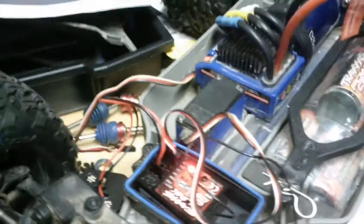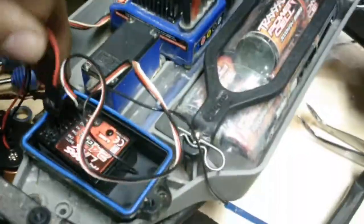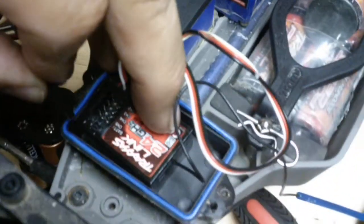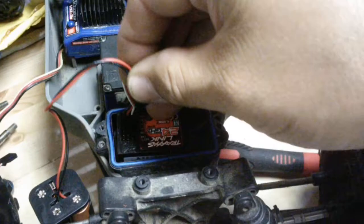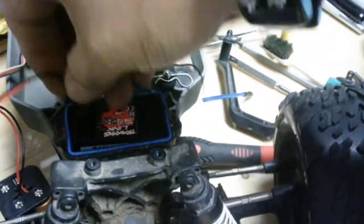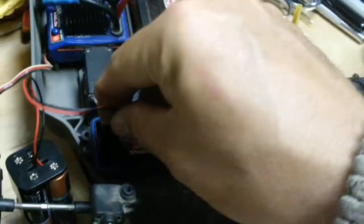You can hear the jittering already without even having a bound system. I'm going to unplug quickly, then turn this into binding mode by holding down the set button and turning it on — we get the blinky red light. Then I'll hold down the link button as we plug it in, and we have green.